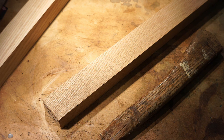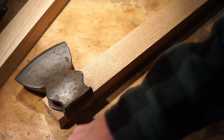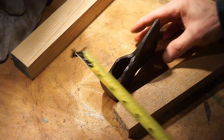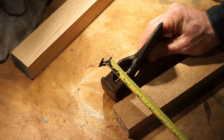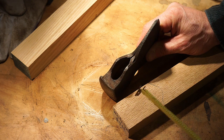I got this beauty piece of white oak, it's about two feet long today, and I'm just gonna figure this thing out and get this axe head on it. I'm just gonna copy the profile of the head onto this piece of white oak and then I'll get carving. The thickness I need is about 5/8 or so, but I'm gonna keep it a little bit fat, so I'm gonna bring this down to about three-quarters to begin with and go from there.